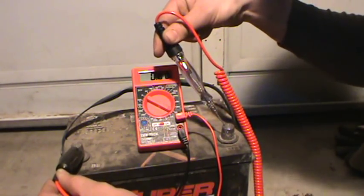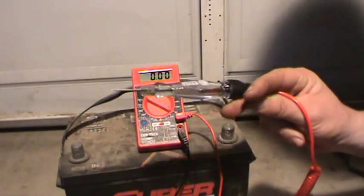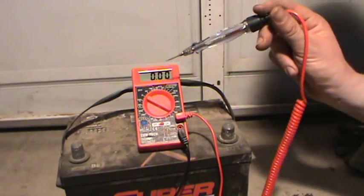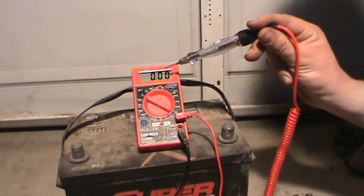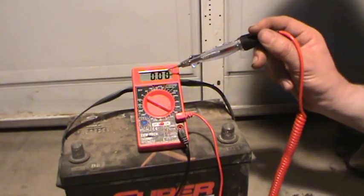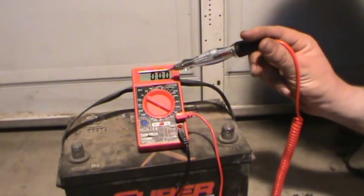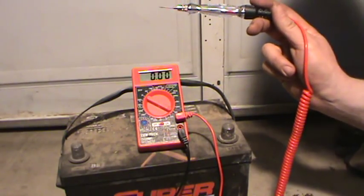You see it lights — I know the light's good. I want to know how much amperage this is going to carry so that when I'm working on computer stuff I know I'm not going to pull too many amps. If it says 0.1 that's 100 milliamps; 0.2 is 200 milliamps; 0.3 is 300 milliamps; 0.15 is 150 milliamps. You want to stay less than 0.5.